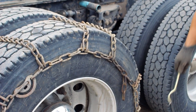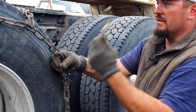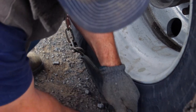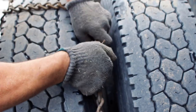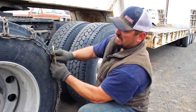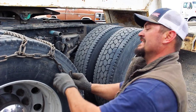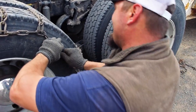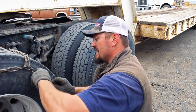These are almost fiddle-string tight and I still got one cam that I can roll over, and there's no bungees on that yet. The number one thing for me is the way that I put the bungee on there — that way I already start with a tight chain. For the most part, all the slack stays out, it stays tight as you go around. One, two, three — it's right there on the inside. When you're frozen and you're cold and you're wet, it's right there.